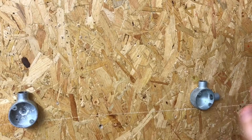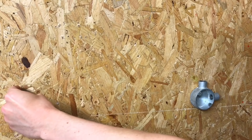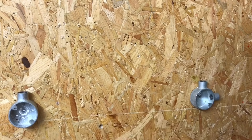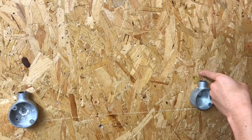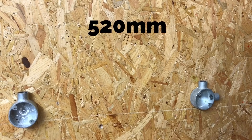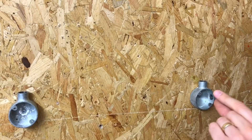When putting the bend in using this technique, you need to know the measurement from back of bend to back of bend. The conduit being installed is 20 millimetres in diameter, so you need to add 10 millimetres to get from the centre to the back of each spout — 10mm on each side. So 500 millimetres plus 20 millimetres gives 520 millimetres, and that is the critical measurement needed for this bend.